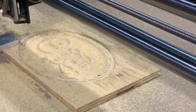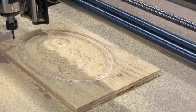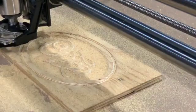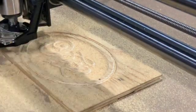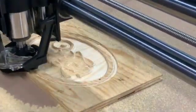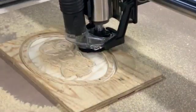This is the final tool. I'm doing a changeover to the same quarter inch end mill for the cutout. Right there you can see me using the tool setter for Z. You can also use it for X and Y, and that is a great addition to the machine. If you've used CNC before with the paper touch off method, that little box is well worth the money — it makes it a lot quicker.